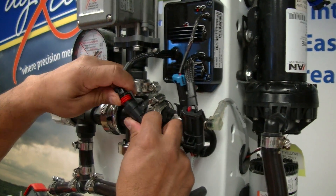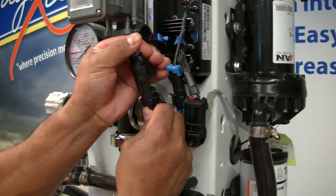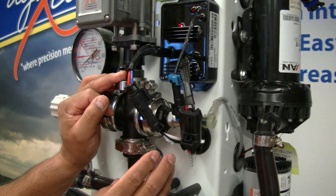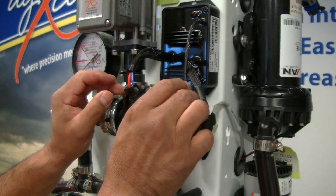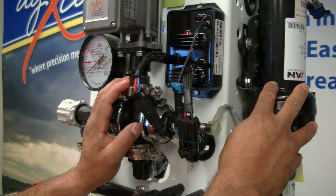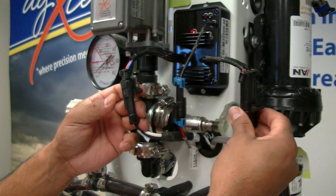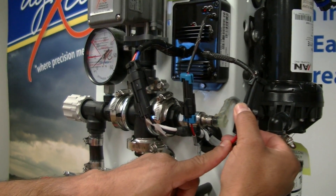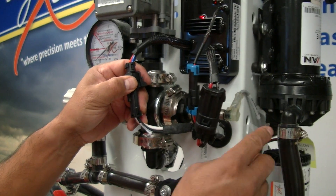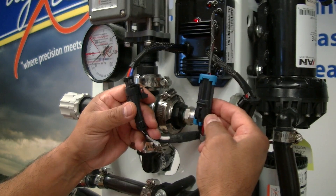When you push the connections together and pull on them, watch for any changes in the LED. You want to make sure that light is flashing steady. Then you want to determine whether it's the controller that's bad or maybe a pump. The red and black harness goes all the way back to your battery; the white and black goes to the pumps; and the smaller gauge white and black wire carries your PWM signal.